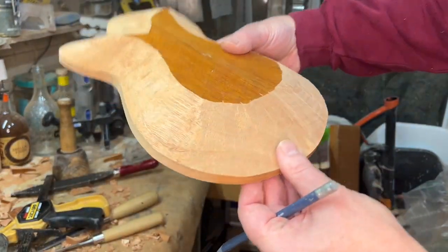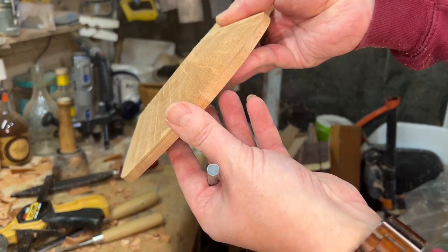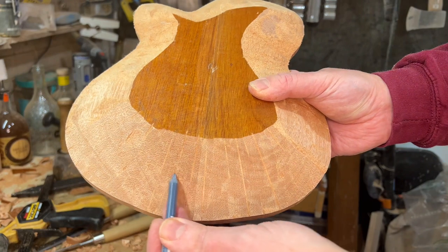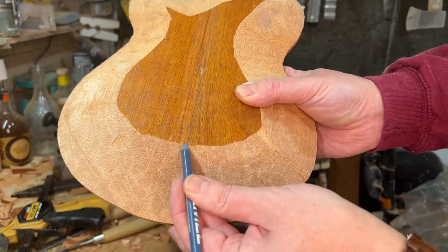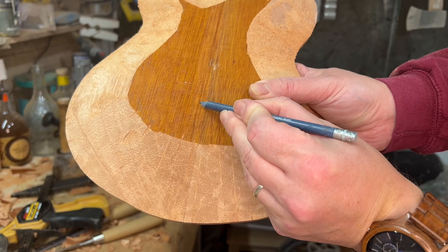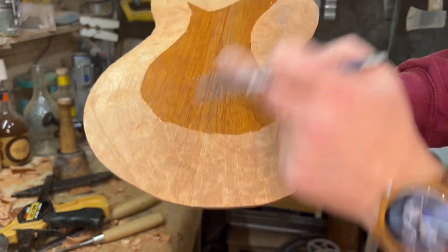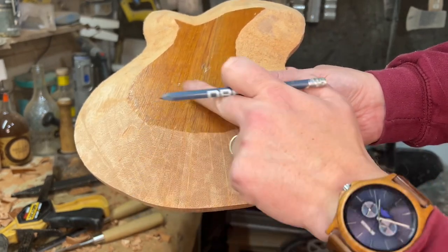I'm just going to go around with the rasp to smooth off those rough edges, then we'll recut the second bevel so it can start creating curves. We can see we're pretty much down to each line, so we know it's consistent all the way through. Now I'm going to do the same thing again — halfway through this new cut and then the same distance away from there — going from this point to this point all the way around again, and it will start to create an arc.